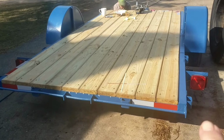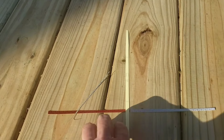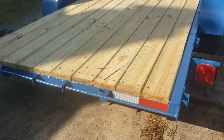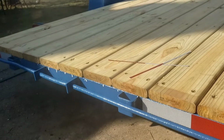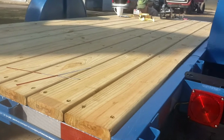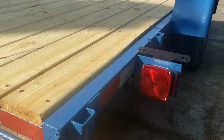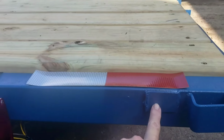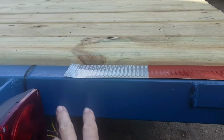So since we put in new metal in a lot of places, this back section, we didn't, but it's a little bit skinny. We went ahead and trimmed off some of the excess to make sure that that's not wrapping under. That'll make a weak spot. If you don't get a good bond the first time, it's not going to be real great. It's pretty warm today, in the 50s, and it's going to be a little warmer every day leading up into the 70s. So these should stick really good. We didn't want to do it when it was cold, so we kind of held off on it. And of course, we're just staying clear of the welds, like I said. There was some excess metal here from something, and we didn't grind that off. So he's just trimming the ends to make it fit.